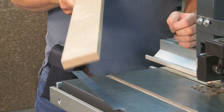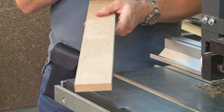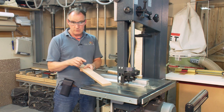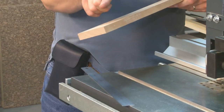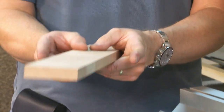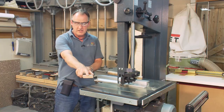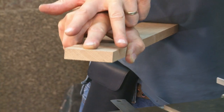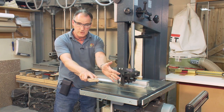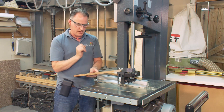I have here a piece of American cherry, and I'm going to divide it into three equal components. This bit of timber has been planed all around, PAR, which means I can cut these into thirds. If it was rough sawn on the outer edges, I would make the centre one tighter to my finished size, and I'd leave the outside two slightly bigger to later on remove the coarse edges. But for this, I'm going to try and get them so they're pretty much the same.